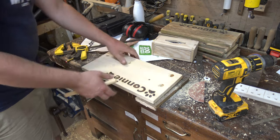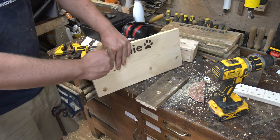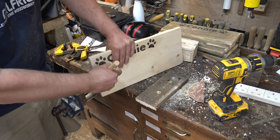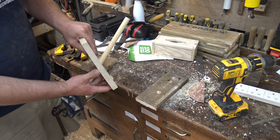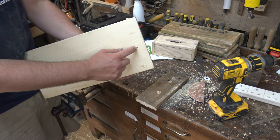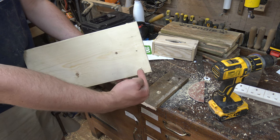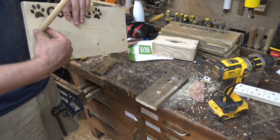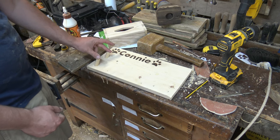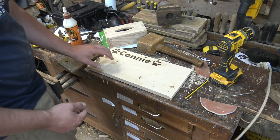So it should be a tight sort of interference fit with these. Obviously we've got to cut the dowel down. Just get them in the hole like so at an angle. So we can trim those down to where we need. And because we've got that little hole coming through from the point of the drill, we can screw through, which would expand this in the hole and make a really tight joint. Just add a little bit of glue into the holes and knock these in. I've got them slightly staggered so they're different sizes, we can get different size leads on.